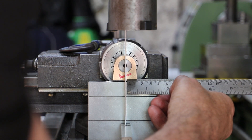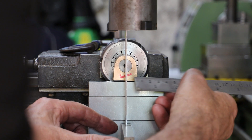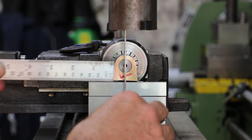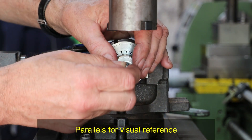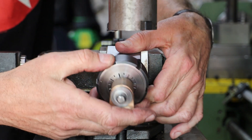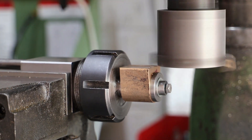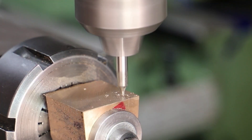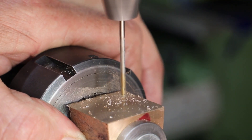I move the mandrel onto the milling machine using a collet block in the machine vise to hold it in place. I now need to machine the base so that it's 16mm from the centre of the bore. I also want to remove the wonkiness I referred to earlier, and I do this by positioning the cylinder by eye. The base is facing the table and I'm using a set of parallels to help me set the position. Once I'm happy, I clamp the cylinder in position on the mandrel and rotate the collet block through 180 degrees so that the base is facing upwards. I've already established the top of the mandrel with respect to my fly cutter, so it's now just a case of bringing the base down to dimension. Drilling and tapping the four mounting holes is a simple job after first having established the centre of the base with reference to the bore.